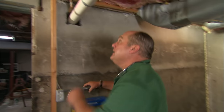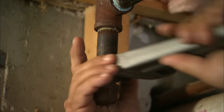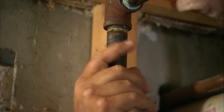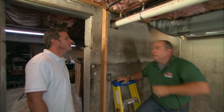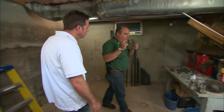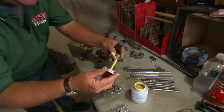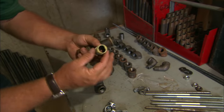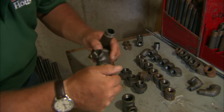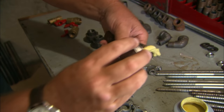With the gas off I can disconnect this drip cap. There might be a little hiss. You're not actually smelling the gas — you're smelling mercaptan, something they add to the gas so you can detect a leak with your nose. All of our connections are going to have pipe joint compound applied to the threads — that's really important, we don't want any leaks. Here's our new tee, and I'm going to reuse this old drip piece.